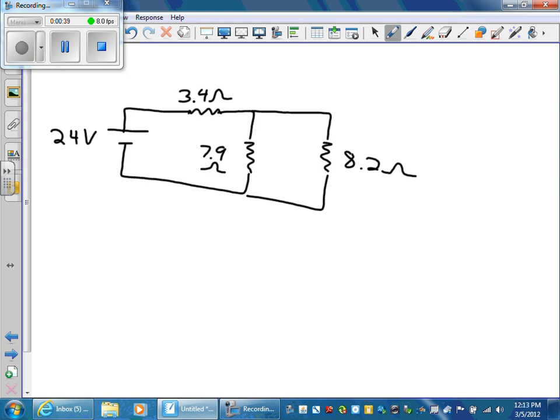And I want you to tell me, just from me giving you the voltage of the battery, what the current and the voltage drop across every last one of these resistors is, using Ohm's law and our rules for adding resistors. So here's what you need to do to start out with. The reason that we use equivalent resistance, the reason that we add all the resistors out like we did with bell work, is to establish a simpler circuit that we can deal with in a very easy manner.